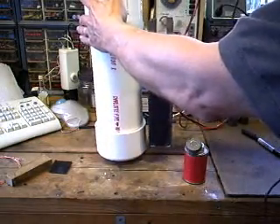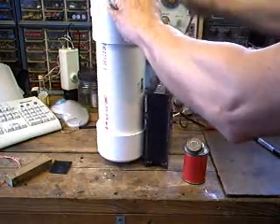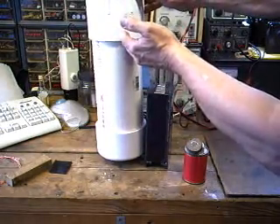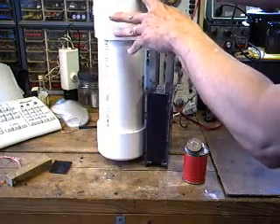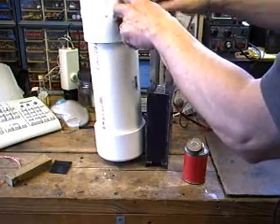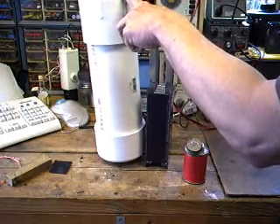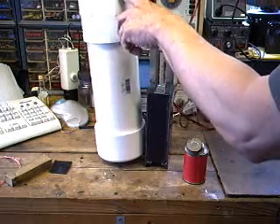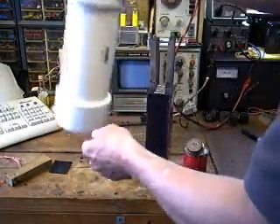This will take a little while to dry, but it will sit in the tube like this. There will be plenty of space above the plate assembly — above the plate brick — for any bubbles to burst and settle out, so that what exits the electrolyzer chamber is pure gas, hopefully. We want to limit the amount of fluid that escapes in the form of bubbles, so I've allowed for quite a bit of space. At the top there will also be a blowout safety device to relieve any pressure should a backfire occur and get back into the cell. It's very unlikely, but we've got to be careful and take all the precautions.